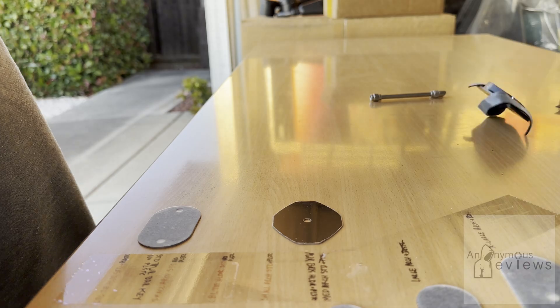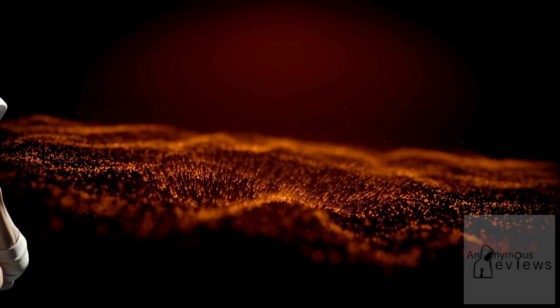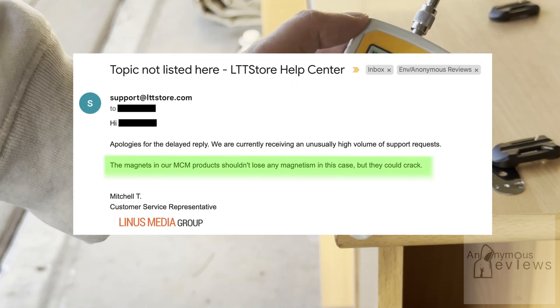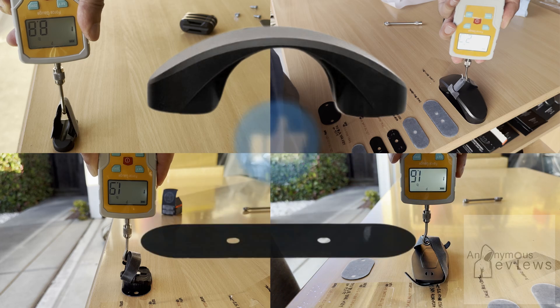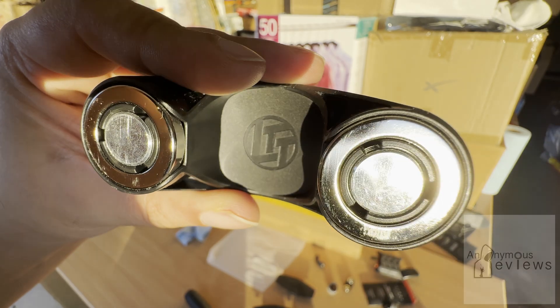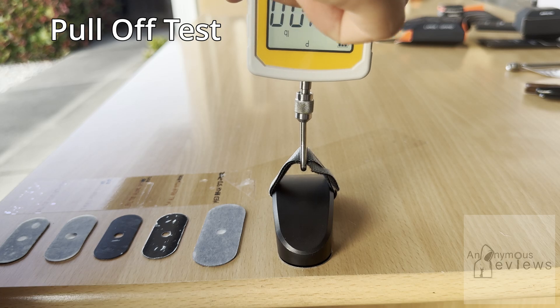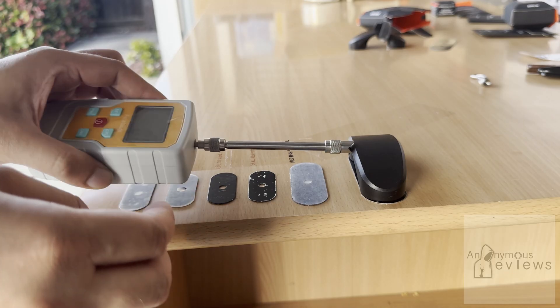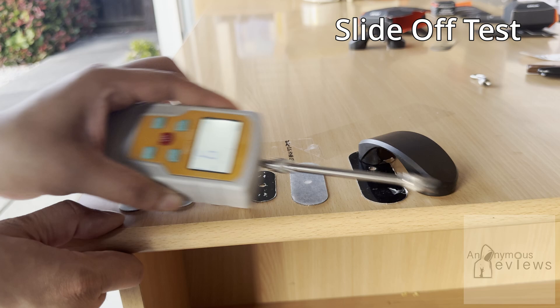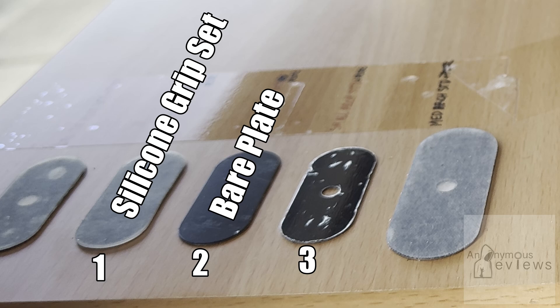I know that many magnets tend to lose their magnetism if dropped or subjected to intense force. I did a bit of research on whether dropping neodymium magnets would adversely affect their magnetic properties, and found that neodymium magnets wouldn't lose their magnetic properties unless they broke apart or chipped. I can happily confirm that none of the magnets flung about in my garage ended up chipping or showed any signs of damage. I performed two types of tests: a pull directly off the plate, in which I pulled the magnet perpendicularly up off the magnetic plate; and the slide test, in which I slide the magnet off the side of the plate. I performed these tests with each item and with three different surfaces: the grip set, the bare plate, and the included plastic film.